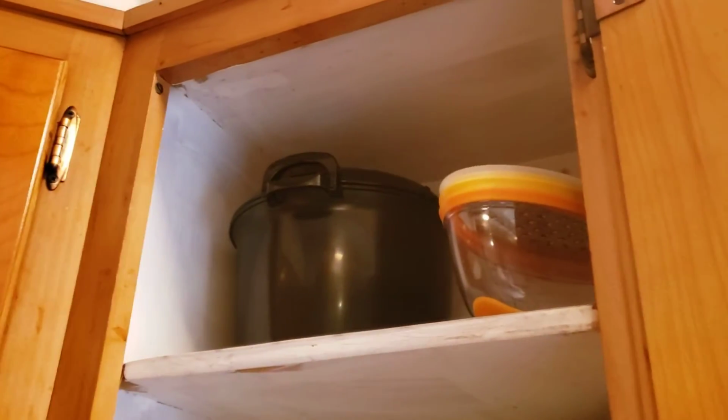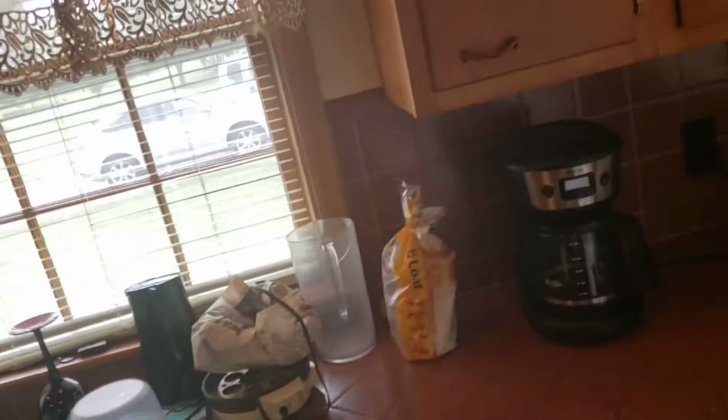And if you look underneath here, you can see more evidence of that. You can actually see the box behind. And if you look inside of the cabinet, there's a ceiling in there. So that box is actually part of the structure of the home. Now, underneath here, you can see there's a light. That's actually part of the soffit. And from corner to corner, the valance had to be pieced. If you take a look right here, they actually had to piece that together because it was just so long across the front of that. So work with the customer because there are some constraints here that we're going to have to be careful of.